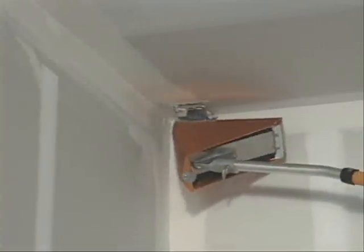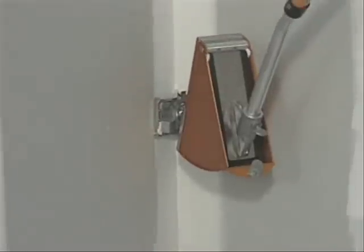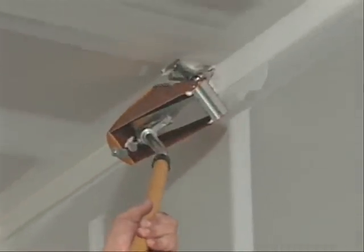To apply the finishing compound, begin by setting the angle head in one corner. Apply pressure as you work toward the other end, keeping the angle applicator centered on the angle head. Steady pressure will distribute the compound evenly and feather the edges neatly.